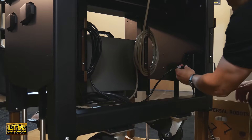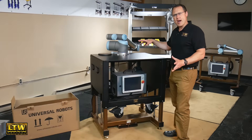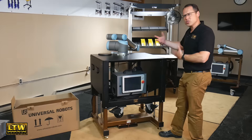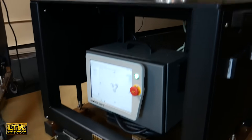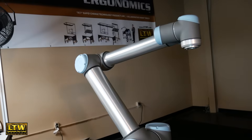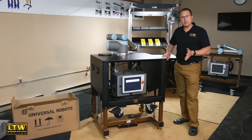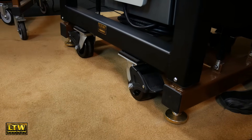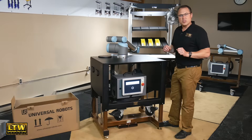Now that we have the robot all securely mounted to our Cobase and the controller all mounted to its frame, with the cords all wrapped up nice and neatly, it's ready for you to power it up and deploy it however you see fit. Whenever you need the robot anywhere else, push the electric button on our patented base, lower it all the way down onto the casters, lift the levelers right up off the floor, and with our new RDS Rapid Dock system you'll be able to dock it right into any one of your stations throughout your plant.